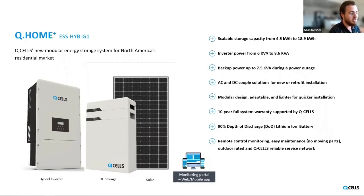This product can do both AC-coupled and DC-coupled applications. In a DC-coupled application, there's no need for an external PV inverter — the solar modules can be connected directly to the Q-Home inverter as it has multiple MPPT inputs. If you're doing a job where there's an existing PV inverter or you want to use a different one, it's possible to do an AC-coupled solution as well. This gives the product good flexibility, so depending on whether your application is new construction or retrofit, this can work for both. If you have an existing PV system that's already wired and connected, you don't have to rewire everything.